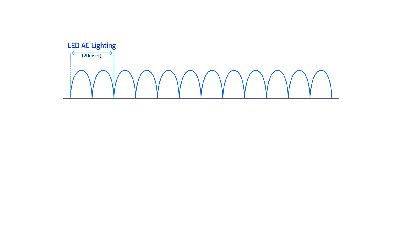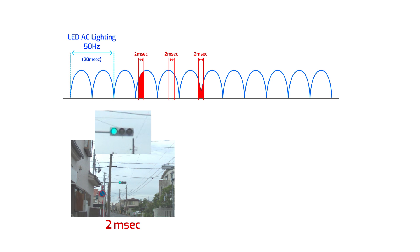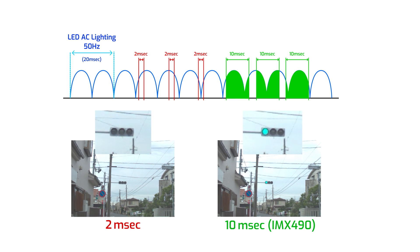In addition, this sensor also offers LED flicker mitigation. Many conventional HDR sensors use a very short exposure time to measure low-sensitivity data to avoid saturating bright areas, and those short exposures more easily capture the flickering of AC lighting at 30, 50, or 60 Hz. But because the IMX 490 doesn't need short exposure times — thanks to the small sub-pixel with low sensitivity — the sensor can be set for longer exposures, capturing more data and effectively averaging out the flickering of the lights.